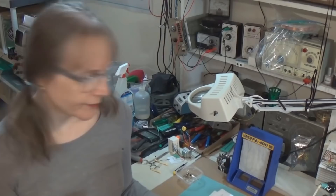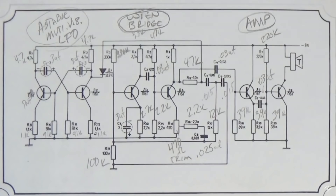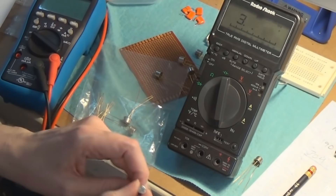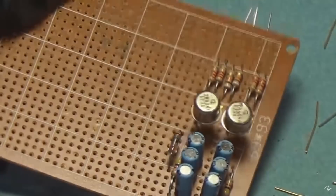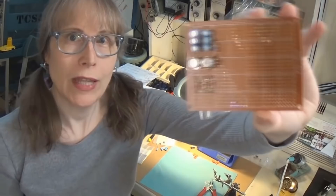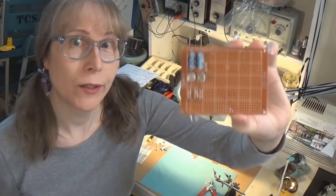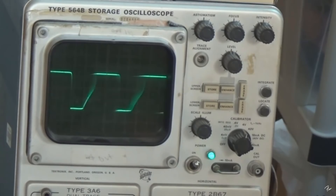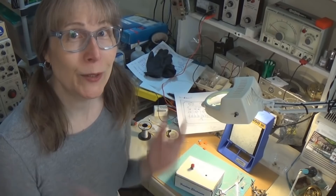Let's go take a look at the schematic that they provided with the model. Here's the schematic — it's my photocopy from the Royal Society. These are 2N404s, as I think they're marked — GI, is that General Instruments? I'm trying to lay out the components exactly the same way as on the schematic so it'll be easier to see how it's oscillating. If you look at the scope trace, you can see it's actually not turning on and off — it's really just sweeping battery. Close it up. First time heard since 1957, perhaps '58 — who knows when the battery went dead. But here it goes.